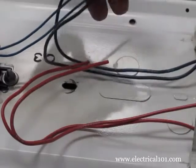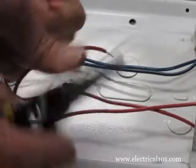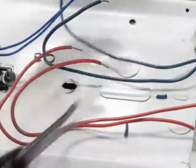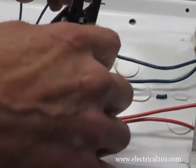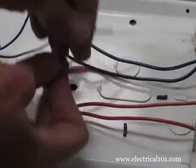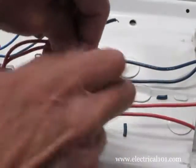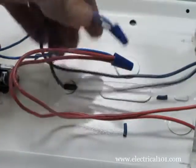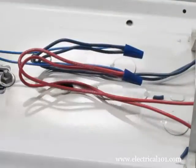Next, do the individual wires. Trim the blue ballast wires as needed, but not the lamp holder wires. Strip the ends of the red and blue lamp holder wires and then the blue ballast wires. Connect the two red lamp holder wires to one of the blue ballast wires using a wire nut. Connect the two blue lamp holder wires to the other blue ballast wire. Carefully twist the wires around each other to form a bundle so they stay inside the cover.